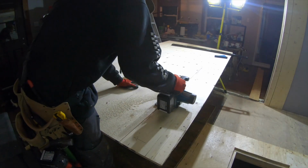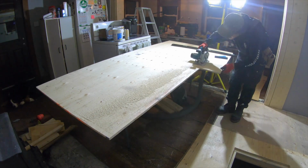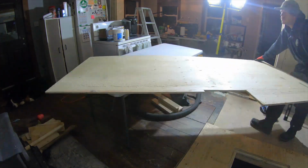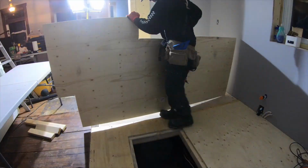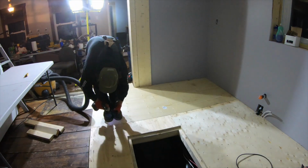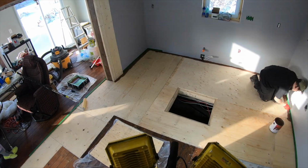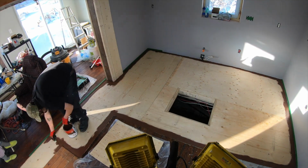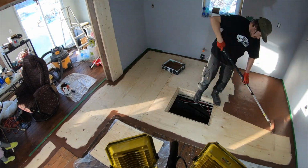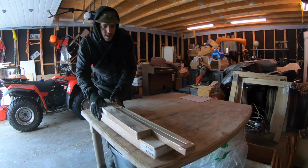Since the original floorboards weren't in that great of a shape, I came to the conclusion that sooner or later, I'm gonna have to replace the flooring on the whole floor. So I decided to put down a second layer of ply in order to have a somewhat even surface, and then apply a good coat of floor paint matching the original color of the floor. It may not be perfect, but it will do until I find a more permanent solution. Now I only had to wait for the paint to dry, so that I could finally get going on the kitchen cabinet.